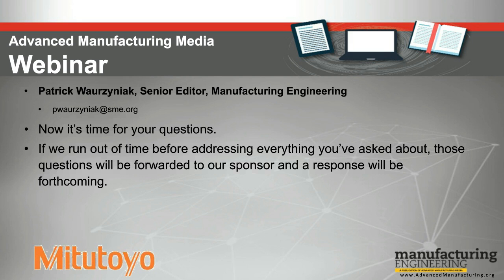But if there's features on the underside of the part, obviously it would be something that we can't do. The part would have to be flipped over to see those features. Unless you're using something like the chromatic point sensor, then you can see through translucent type materials, where you can measure the top and bottom simultaneously.